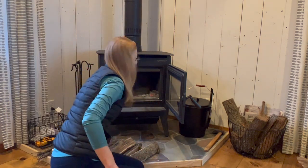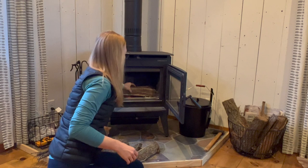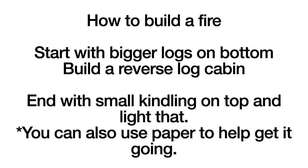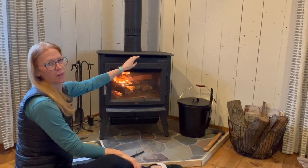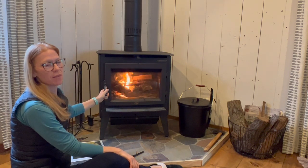We give you a bunch of newspaper to help start, we have some fire starters — whatever you like to use. While you're getting your fire going, you need to have your bypass and your air control open. It also helps to have the door cracked a little bit to get a bit more air flow.